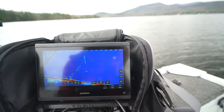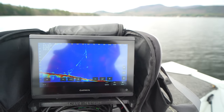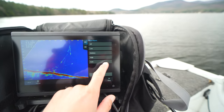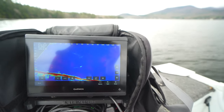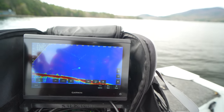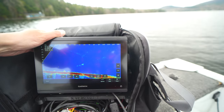The image clarity on this is absolutely fantastic. Right now we have a little bit of what's called ghost tree — these are actual returns coming back from the sonar and basically hitting themselves, that's the way I understand it. I can turn some of that off by going to sonar setup, ghost rejection on high. I can turn some of that off to make it look really pretty, but I'd rather have the information there. And see how it lags still a little bit — this is a $1,400 head unit. The head unit does a lot of work, and the GLS 10 black box in the back does a lot of work.